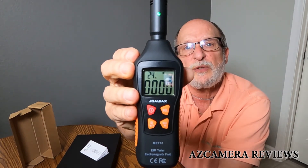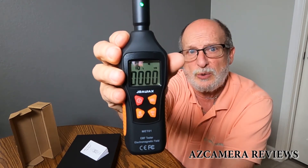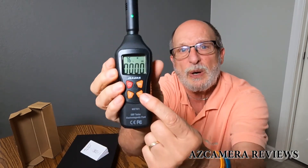So now you can see it's 24 centigrade. I'm going to switch it back to Fahrenheit. And now if you push it again quickly, you'll see an H comes up — that will hold your measurement. So if you're taking a measurement and it's moving a lot, you can hold the measurement. Then you take that off and you can go into the next one, which says maximum.